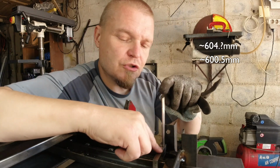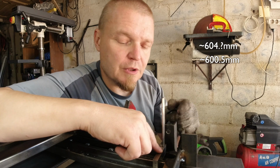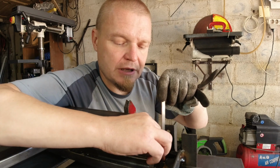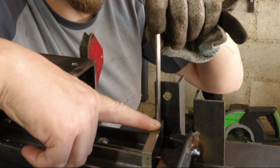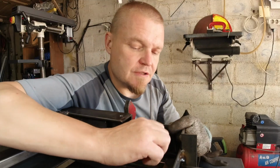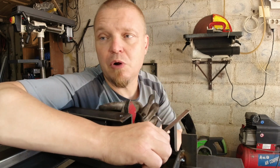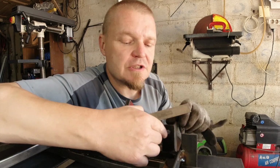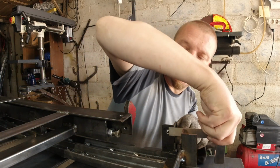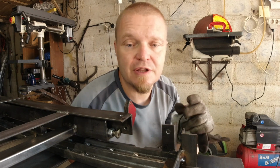A lot of this is due to that the angle iron, which is the pivot point, is not perpendicular to the U-channel, and it can be illustrated by doing this jiggly movement here. So the easiest way to deal with this would be to bolt the legs on, and whilst doing that you somehow stick in some washers in here between there, and you probably never take them off and everything would be fine.